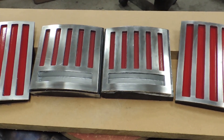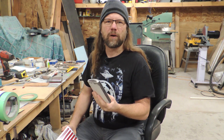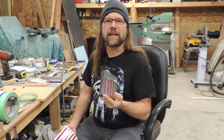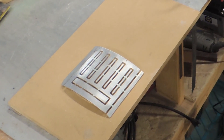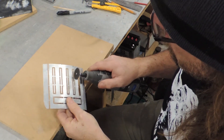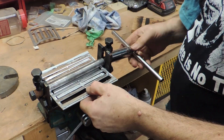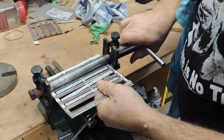I've used this method again on all the body vents and I'm really happy with the way that they've turned out. I think in a perfect world these would have been machined from aluminum or possibly assembled from stamped aluminum sheet or something like that. I modeled these to be printed and I left allowance this time for a three millimeter face plate. The plastic was printed and painted, then I cut the face with my CNC router and I used a slip roller to form the contour.